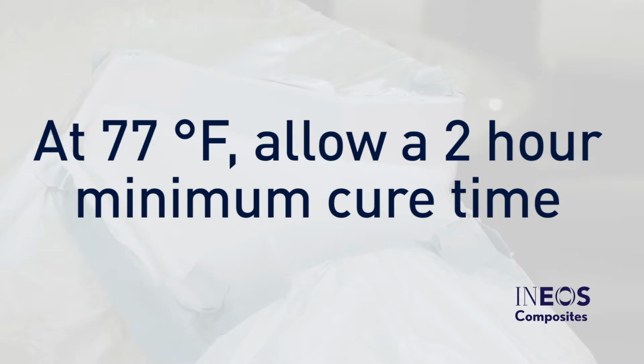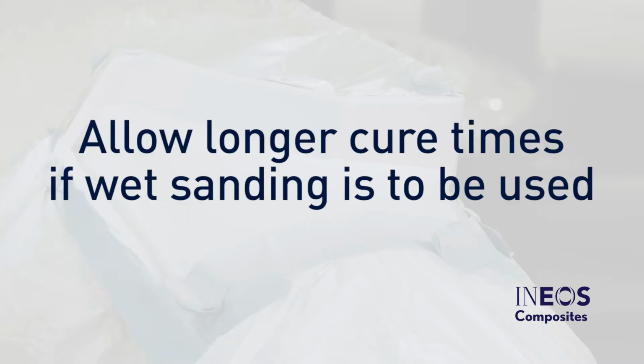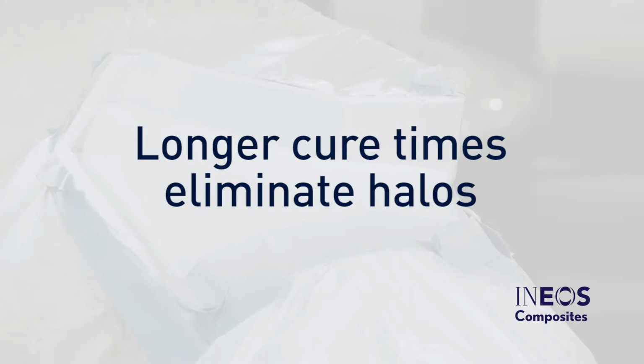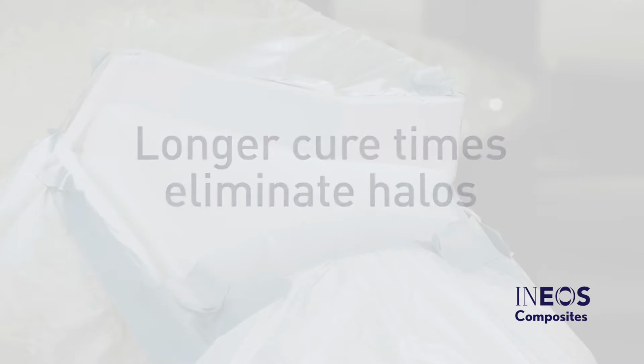At 77 degrees Fahrenheit, use a minimum of 2-hour curing time. Additional time is wise if wet sanding will be done after the cure. Darker colors will need longer time to cure before sanding and buffing. The longer the Gelcoat spray patch cures, the better the color match will be. A longer cure will also help eliminate the chemical line, or halo, around the patch.